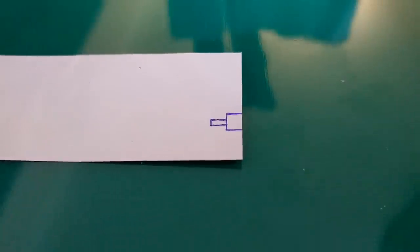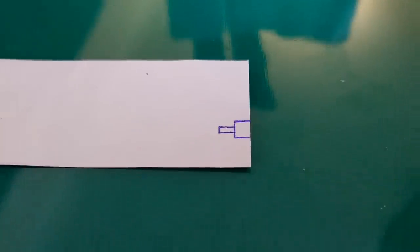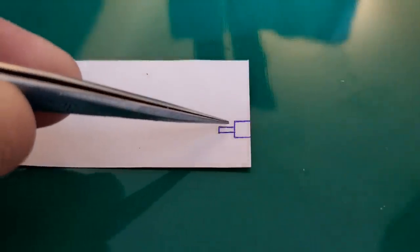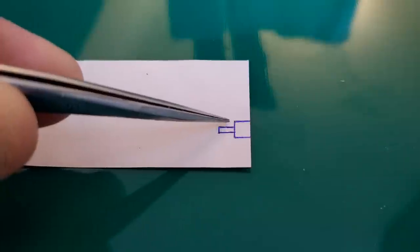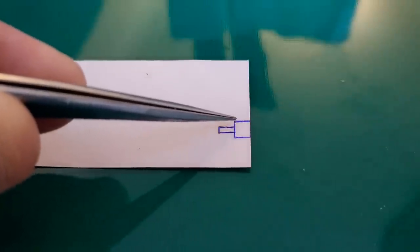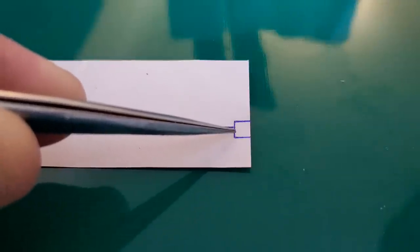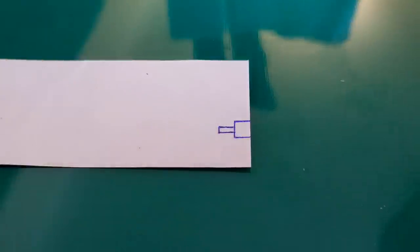So anyway, what I've done here, as you can see, I've got the copper tape on your screen. Now on the back of this tape, it's normally adhesive backed with a paper backing. All I've done really is measure the missing pad and trace off the board, and recreate the same measurements onto the paper backing. All you've got to do then is score around that with a scalpel and a ruler, and cut that exact shape out, and that should fit nicely onto the missing pad and trace on the board.